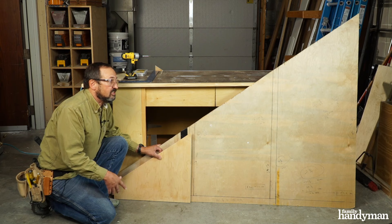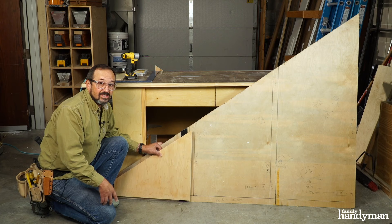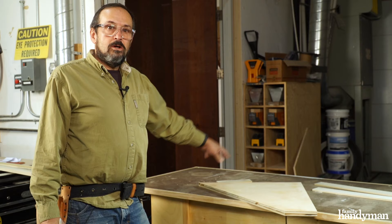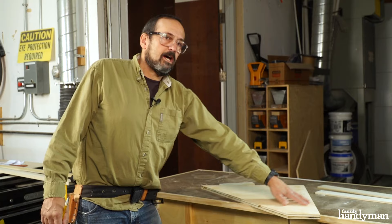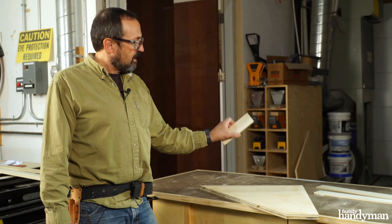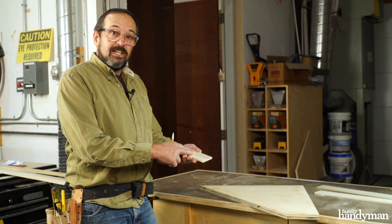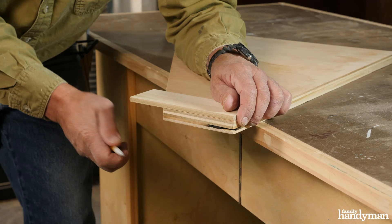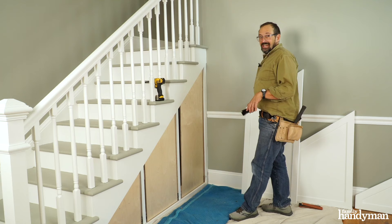Building in a diagonal opening is tricky, so I made a luan plywood template to make sure that my doors are the right size — I simply held the doors against the template and checked that they were the right size. With my door face cut out, I'm going to apply the perimeter trim — this quarter-inch by two-and-a-quarter poplar. Keep your factory edge facing out, and the easiest way to mark these is to put them in place and give them a mark for your cut line. Cut your sides or stiles first, then do your top and bottom rails, so you don't see any ugly butt joints on your top and bottom pieces.